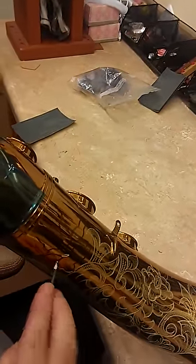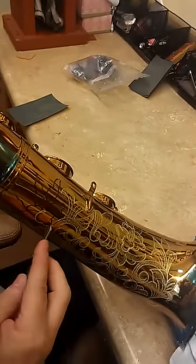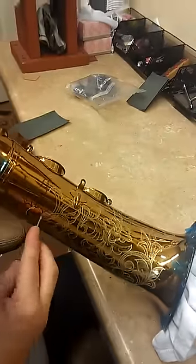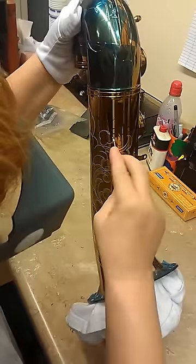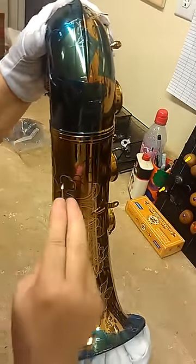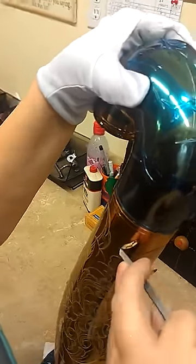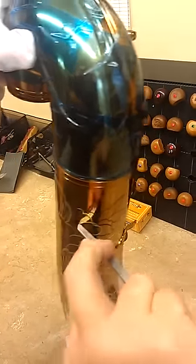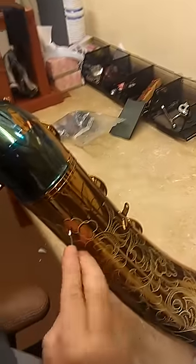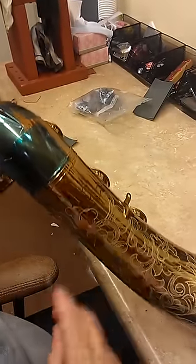As you can see, I have to continually be moving as I'm engraving to work around the saxophone bell, because it's obviously not a flat surface — it's a rounded surface. That requires continuous motion to keep that tool moving, to prevent slippage, and to maintain a continual pattern with symmetry on both sides. After doing this as many years as I have, it's a feel — you can just feel that you've got the right angle.